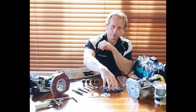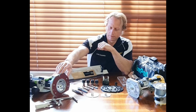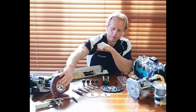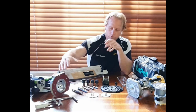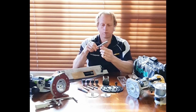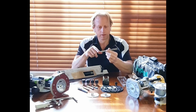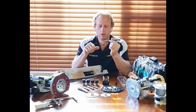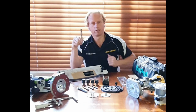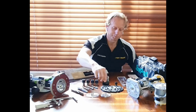So I've been using that recently. I've been working with this router. We'll work something out. If you use a 24mm copy ring, that means you have to have a 20mm bit to have that 4mm difference, which is not impossible either, and you can buy them easy. I may be able to get this type of cutter in a 20mm and a longer reach. This one's 130mm long, and I'm going to be getting 160, and that's for advanced routing, plunging deep for lock bodies and pivots and things like that.